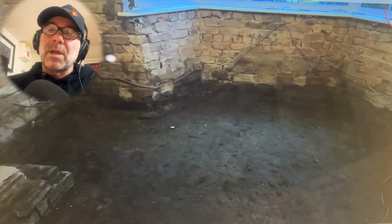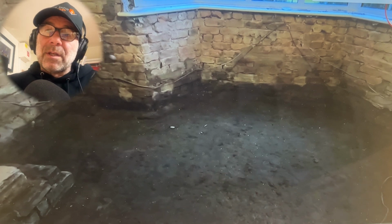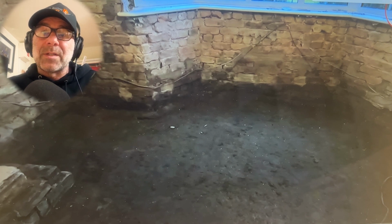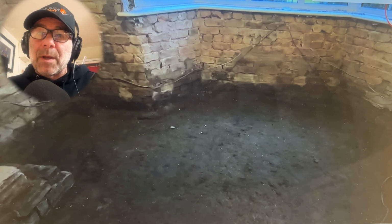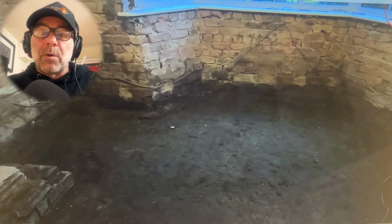And listen, I've done videos on them. If you go on YouTube, search for Dampsam, I've done loads of videos on different scenarios. I'm not saying it's a simple fix, but it's not a fix that needs waterproofing at all. One of the things you can do is clear out the subfloor. You can either concrete it, put a membrane down and concrete it, or if you don't want to go to that expense, just put a membrane straight on top and make sure it's adequately ventilated, and then reinstate your timbers. Make sure all your timbers are isolated on the ends. Paint the ends with liquid DPM, sit them on a plastic DPM when you put them in the wall, wedge them so it allows air to flow around them rather than putting mortar up against them again. So lots of things you can do other than tanking.